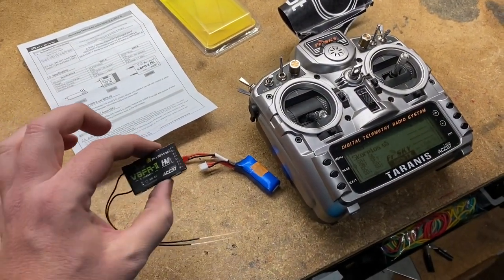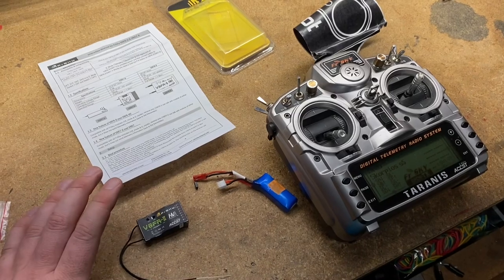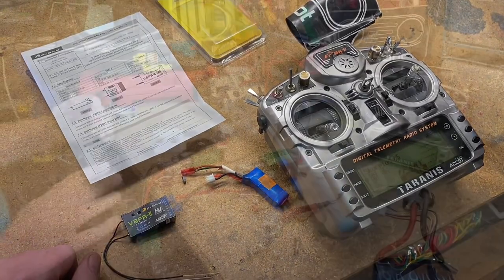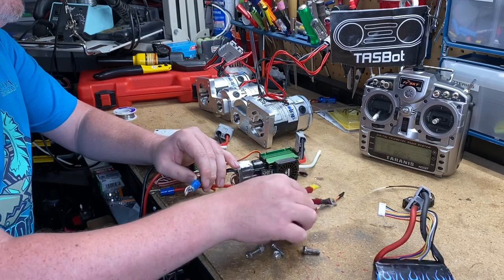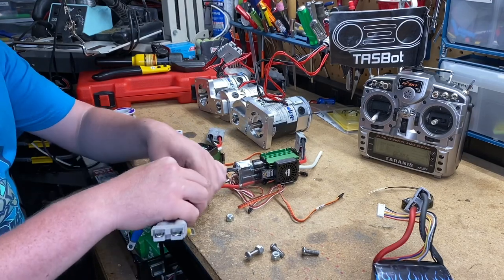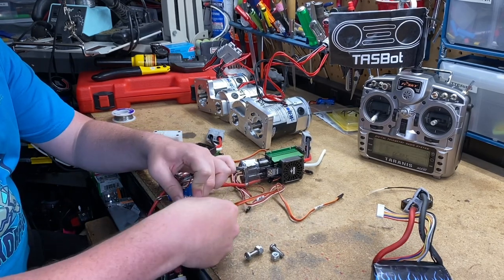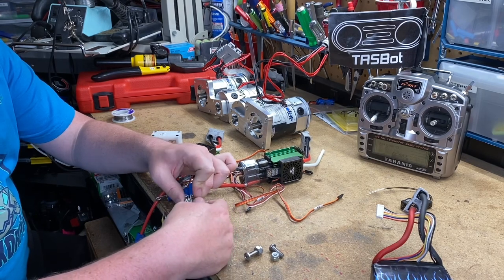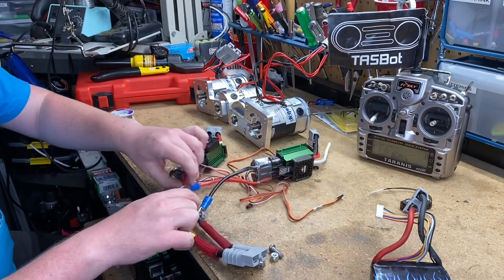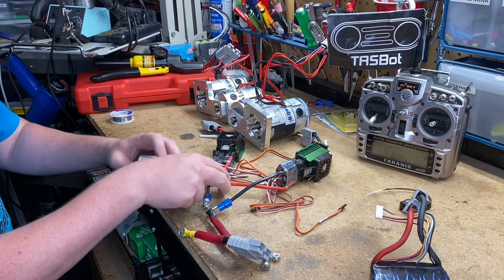I bound this receiver to this radio following the instructions as included. I'm not going to go through this because it's different on each radio system — the radio you choose will have a unique binding setup. We have all our connectors on everything. We're going to connect the three black ones together — just line those guys up, grab a quarter-twenty screw, and tighten that down. Then make sure to electrical tape it. The BattleBots safety people will come by if you have exposed terminals — they will tell you to tape that up and fail your robot safety check until you fix that.